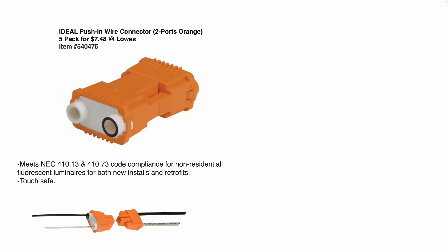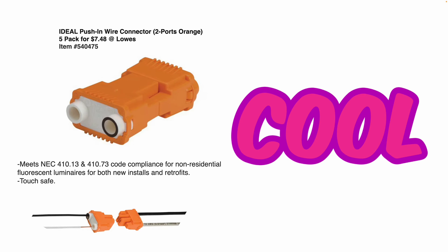You're able to unplug that fixture when you go to replace a ballast. For example, if you're doing work in a hospital where you can't shut the power off to the entire floor or to that suite or room because it's an essential circuit, you can unplug this connector to safely replace that ballast while keeping the other lights on.